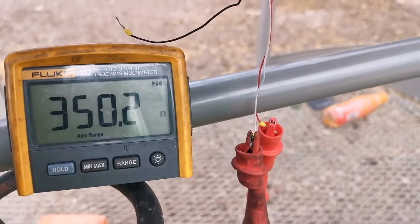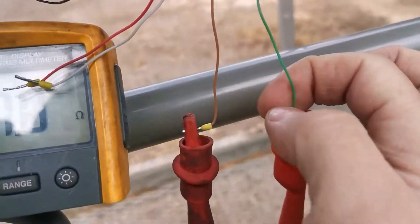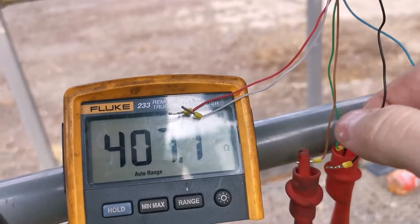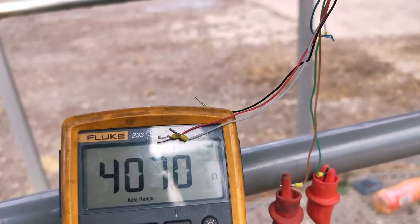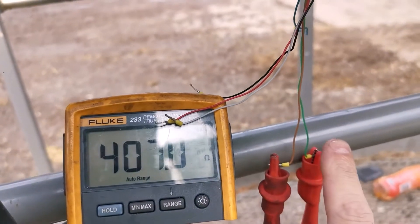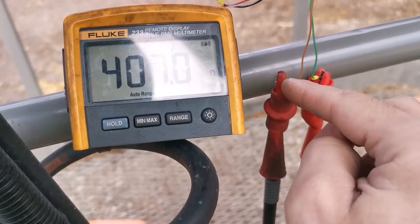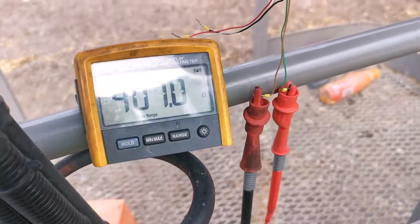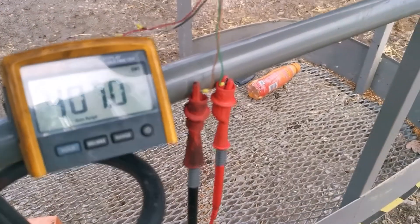So what I will do now, we'll move the wires on to the input side. So input side is green and brown - or it could be blue and black. You should have the same reading, because brown and black they are linked together, and the green and blue they are linked together. So we measure between input of the load cell, so green and brown, and we have about 407 ohms - so about 410 to 412 ohms. I think it's okay, it's not a problem there.